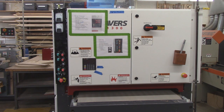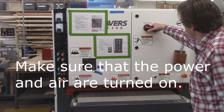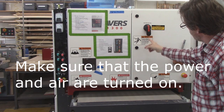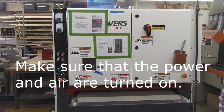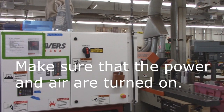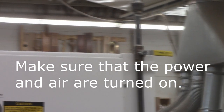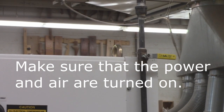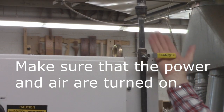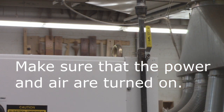When you come up to the machine, you need to make sure the power is on by turning this lever so the red is going vertically. You also want to make sure it has air, and that is achieved by turning this in-line handle in line with the pipe. This is a ball valve — you can tell a ball valve is open when it's in line with the main pipe.